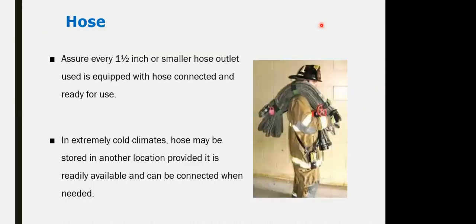Okay. By the way, all the cabinets should be marked physically on site. You have to install the sticker for the fire hose cabinet, giving indication, with a printout, signage for this one. Not only the stickers or the sign or the marking, you have to add an emergency light on the top, very close to this area. So in case of fire, the emergency light can give you a direction of where the equipment is. Okay.